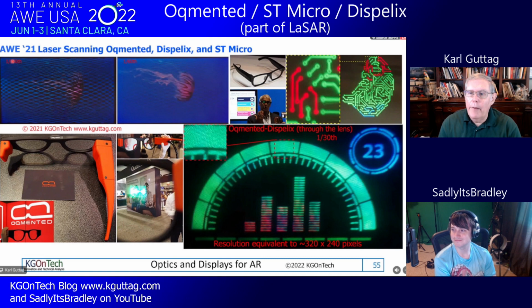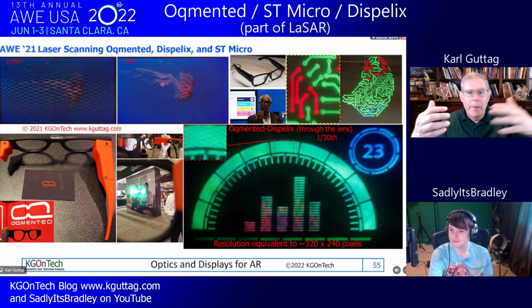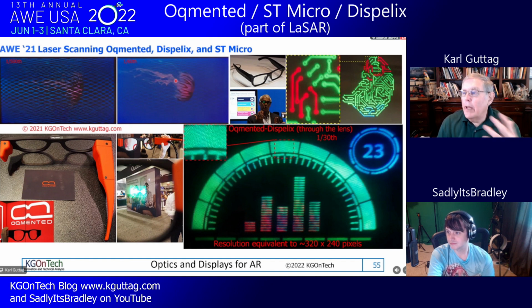But like here, I took a high resolution, high-speed picture at 1/500. The problem is this checkerboarding thing. It's basically randomly hitting the pixels, but you've got to realize what your eye does is integrate light over time. So in some places, like where the beam crosses, it's going to be brighter than the gaps where it misses. You keep doing this again and again, and you still get bright hot spots and dark spots. It's kind of like a random walk to try to hit the pixels, but you're not hitting all the pixels the same amount. So how would you ever compensate for that? How would you make the image look uniform? I don't think it ever gets there. I think it's the wrong technology.